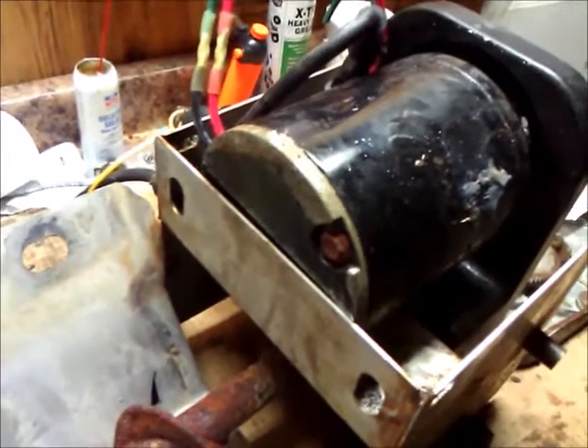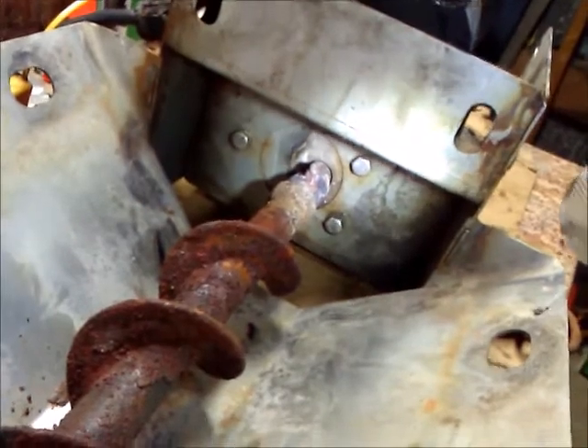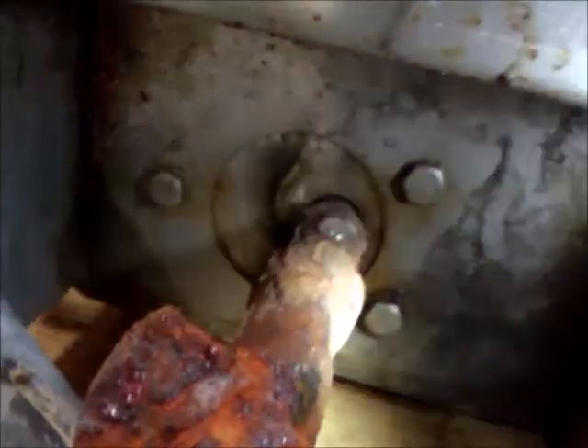They sell the whole unit, which is a lot more expensive than just the motor. What I've done is loosen that up, and that brings me to step number three: I need to try to disconnect the whole auger unit that they would sell from the factory. To do that there are three bolts I'm going to remove. The problem begins when you have an old unit — you may or may not be able to see that there is a shear pin or cotter pin that holds the auger unit to the gear drive assembly. When it's so rusted you can hardly tell it's even a pin anymore.